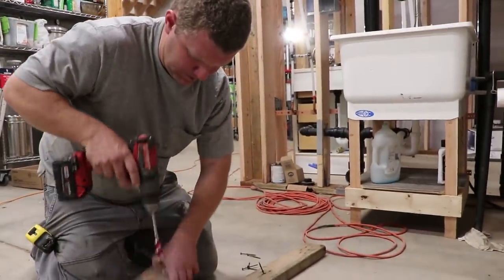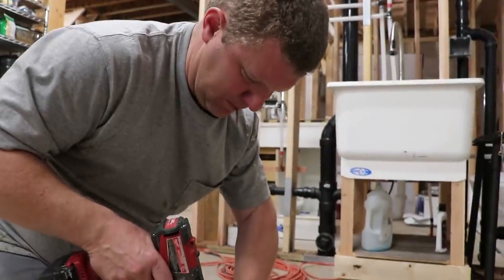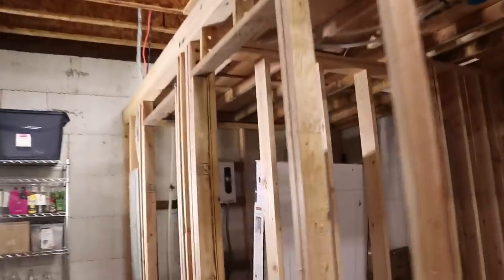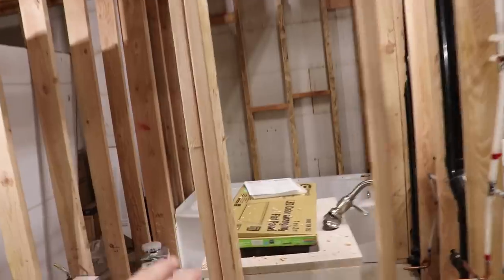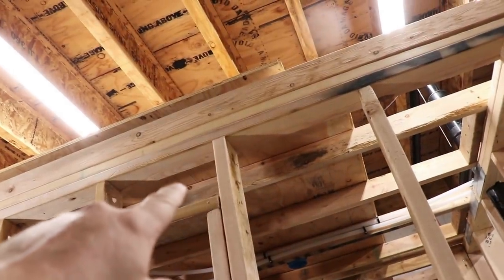Much better. So, what you can do is we'll get the big, huge coil of Romex. Okay. And we can put the coil right here. And then I'll have you just pull wire from, probably give us a couple feet extra. Right, this is for the... Yep, that's a home run. Easy chaining off the one in the back.